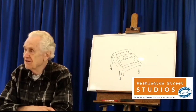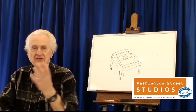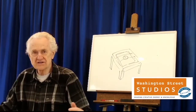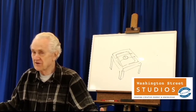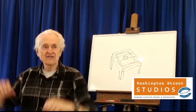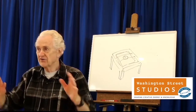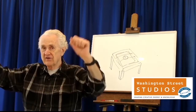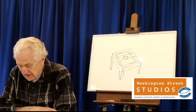Another feature I look for is, is there a counterbalance on the lid? Is there some kind of counterbalance mechanism to help so that you're not lifting the full weight of the lid? On some of these large kilns, like these large oval kilns that are like 4 or 5 feet long and 3 feet across, the lid is really heavy. Depending on what your stature is like, if you tend to be short and this thing has to go way up in here, it's really hard by yourself to lift the lid. So more and more now, kiln companies are adding some kind of a counterbalance, either a spring or some kind of a mechanism to help take the weight off it so that you can swing it more easily. So again, it's not critical, but it's a nice feature if there's some kind of a counterbalance.